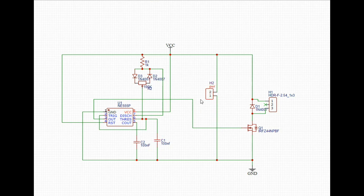The timing is controlled by this 100 nanofarad capacitor, and this is just where the power comes in. Over here is where we have our MOSFET, and right here is where we have our diode to control the flyback from the motor. When the motor shuts off — because the motor is an inductive device — there's going to be a voltage spike as that inductor discharges. We don't want it to feed back through the MOSFET and into the 555 timer, so it will discharge through this path and back into the motor.